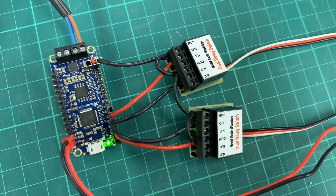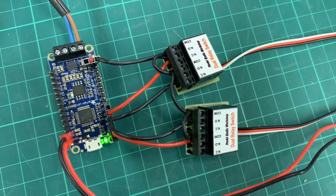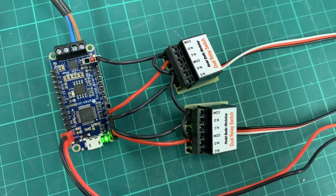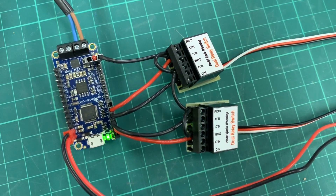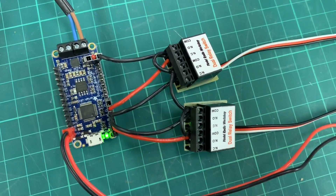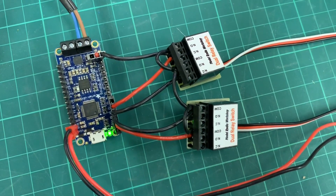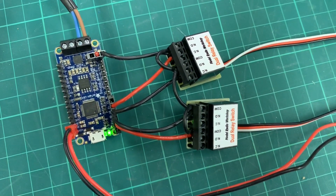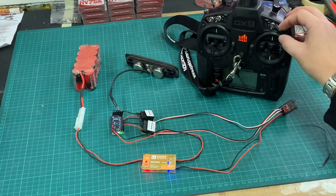This Adafruit board is a bit like a drive — when you plug it into your PC or Mac via USB it just comes up as a drive, and you simply upload the sound files. The instructions are easy enough to follow. You can have just one sound, random sounds, or sounds in order, but it's always 10 sounds per pin — just remember that. Apart from that it's very simple to use.